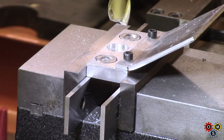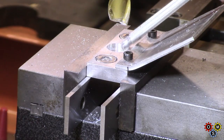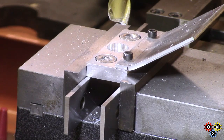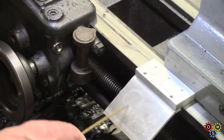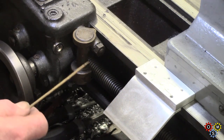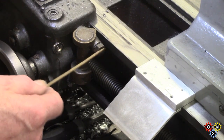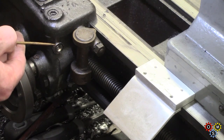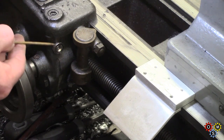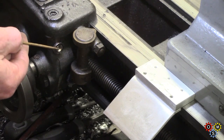I had second thoughts — the two magnets hold quite well, but I've decided to add a third one. I've gone down half a thou deeper so hopefully it won't rock on them. I've got this to a suitable angle. I've drilled here to tap further — a 3 mm by 0.5 — so I can hold one of these countersunk button neodymiums.